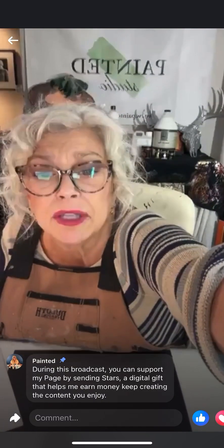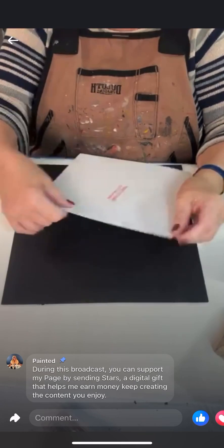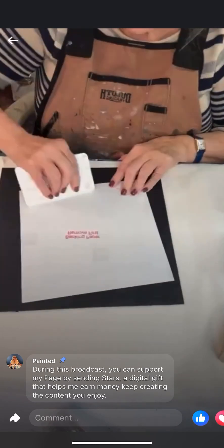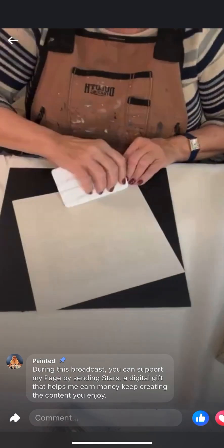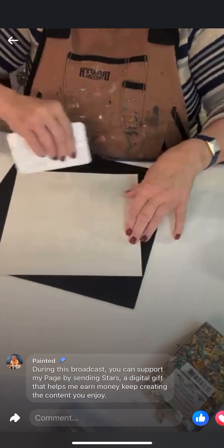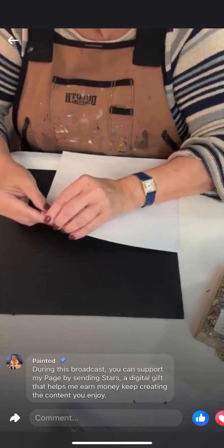So today we're going to gild on a piece of Baltic birch. We carry these boards — they're one foot by one foot and one and an eighth inch thick — and I use them for furniture samples and for testing product. We've painted this with two coats of set coat black because we're going to be using our Roberson's water-based size for gold leaf.